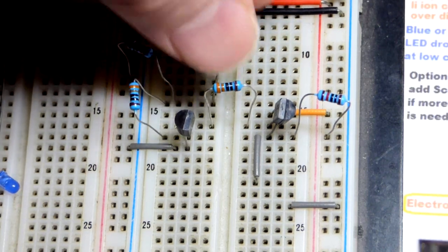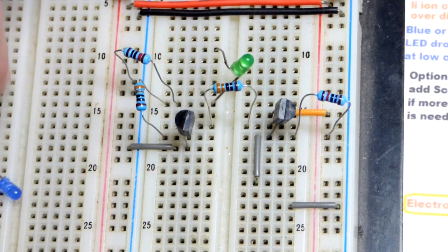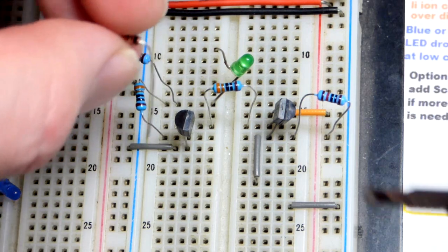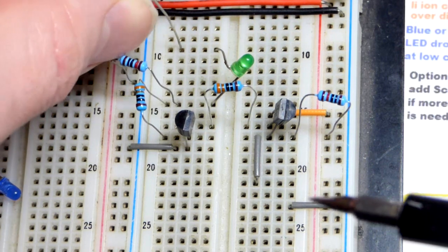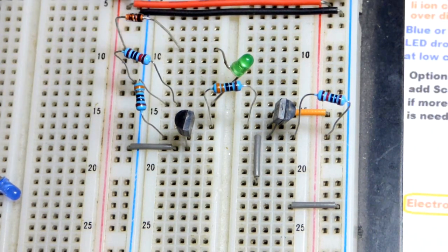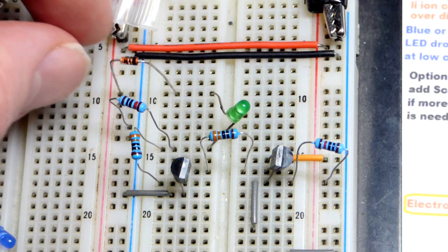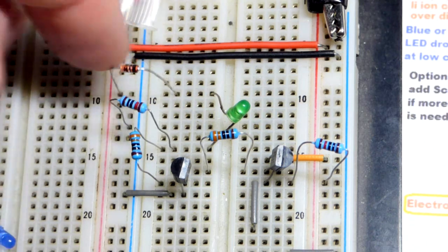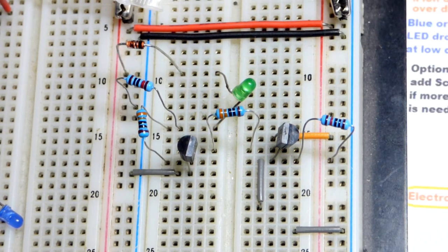Both diodes are forward biased — the direction they conduct easier — but if the voltage drops enough it will still stop conduction. This is a Schottky diode with a black band right there; I got it from the Joe Knows Electronics semiconductor kit, which you can find linked on my shop page. With the green LED I'll put the Schottky back in since we saw we needed that extra voltage drop. There's a closer look at how it's wired on the board — I hope you enjoyed. Make sure you check out the other videos posted on screen and the links down below; they all help out a lot. See you in the next video.